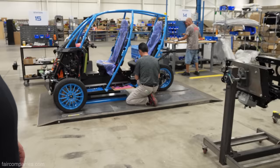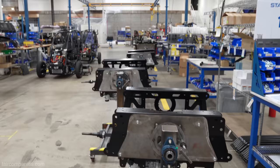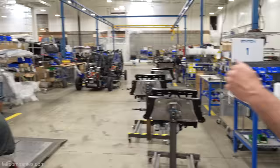This is station one. They begin with a front carriage right here, this electric power steering unit underneath, and they're going to start building the front assembly. If we look out to the right, that's mechanical sub-assembly pre-build — it feeds the line this way. If you look up to your left, that's electrical sub-build — it feeds the line from the left.